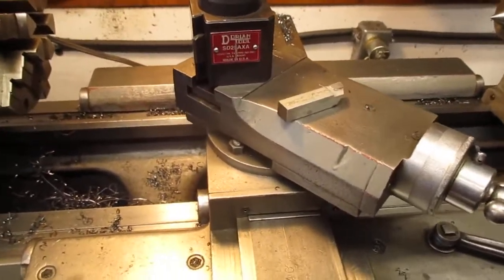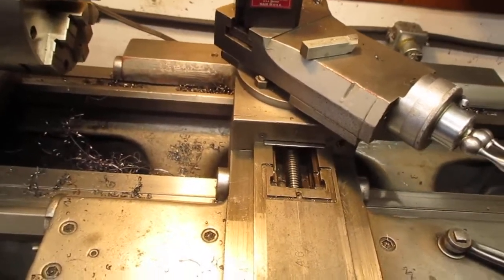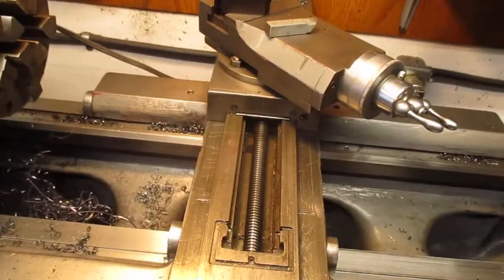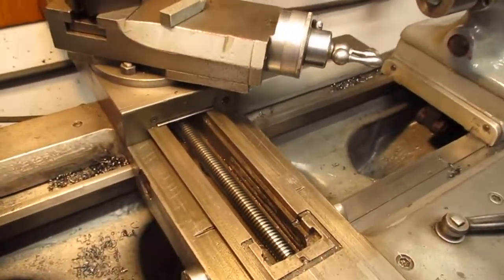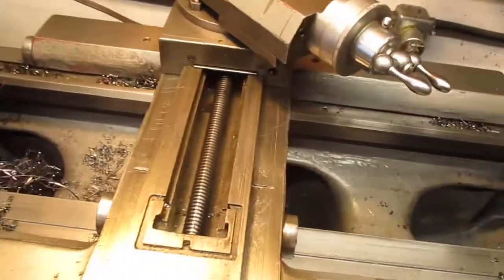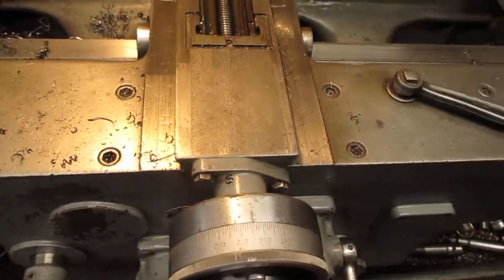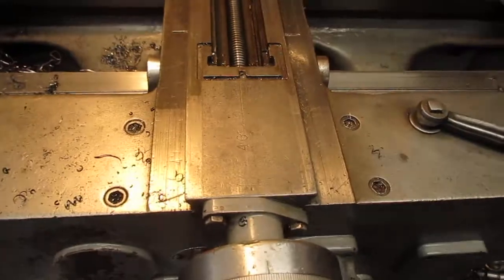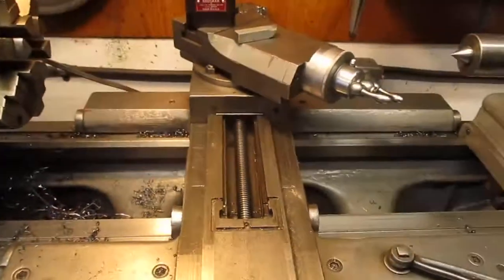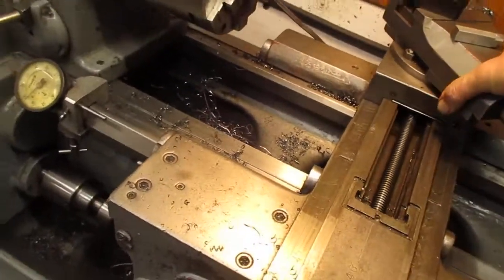You just crank it all the way out — look at that, it's going to stop, then shove it forward. It won't come all the way off because it's too close to the wall. There's the cross-feed screw right there — it's got a lot of oil on it, I'll oil the crap out of it. This one I also set so it reads ten thousandths on the dial before it catches and moves either direction. Very simple — kind of like a nine-inch South Bend. No taper attachment or anything. You can pull it back and stab it right in.